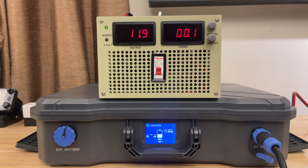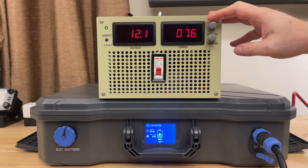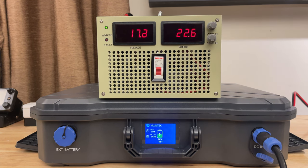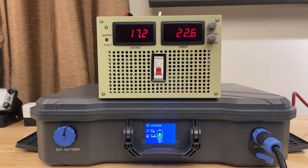We're at 49% charge and 90°F internally from the previous test. At 12V (minimum), we're pulling about 6 amps. At 13.8V (regular car voltage), about 8 amps. Right around 15V it jumps up and wants to pull significantly more power. At 24V car voltage it tries to pull 22 amps — way too much for a cigarette lighter port, so for a 24V vehicle you'd need to hardwire to the battery. At 19V (standard single-panel voltage) we're pulling 22 amps and 397 watts.